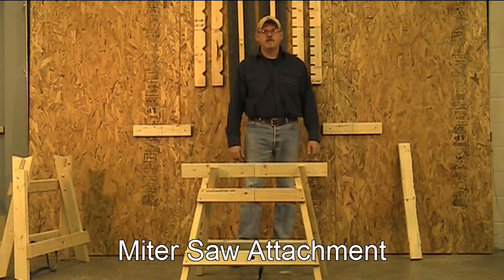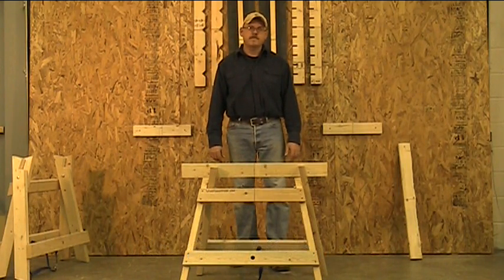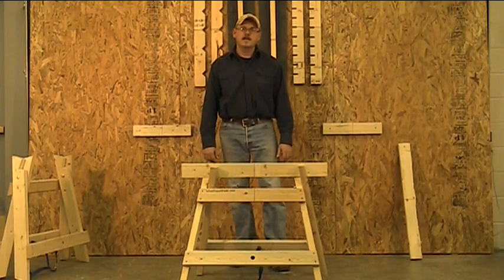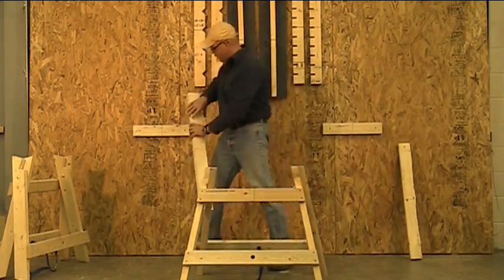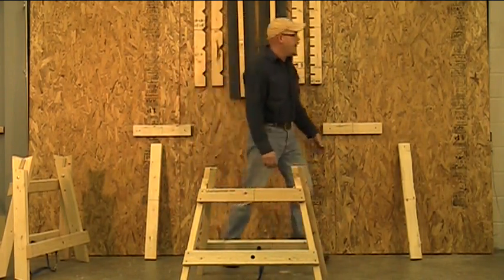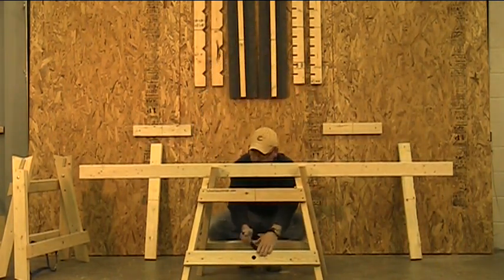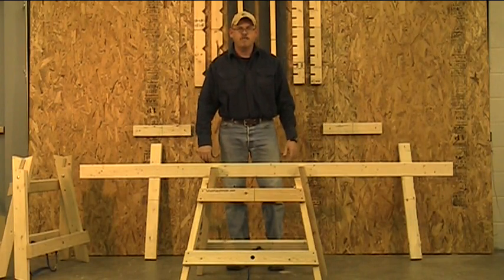Another great attachment is using the Shop Dog as a miter saw stand. Many times you buy a miter saw stand from a big box store and they're expensive and only used for holding a miter saw. If you have a Shop Dog on site, you're able to transform it into a miter saw stand pretty effortlessly. First, remove the top support. Go to your pile of 2x material — it could be a 2x4x12, a 2x4x8, whatever your needs are. Place it in the Shop Dog and crank it up so it's nice and tight. The ends will be used to hold supports made out of scrap 1x4s.